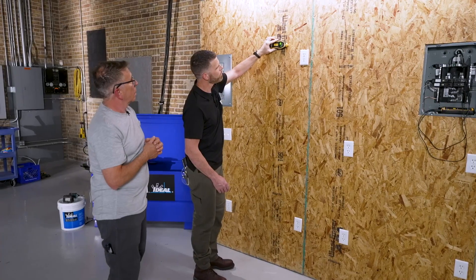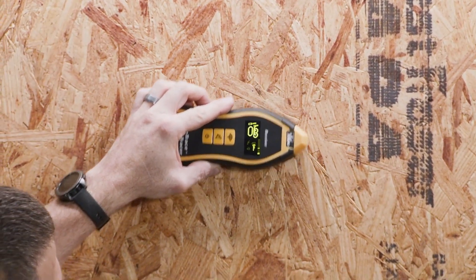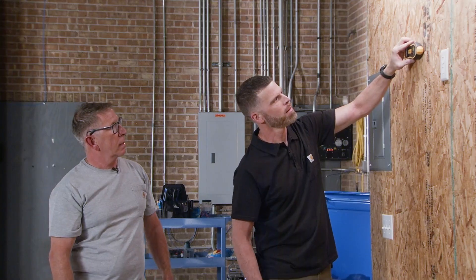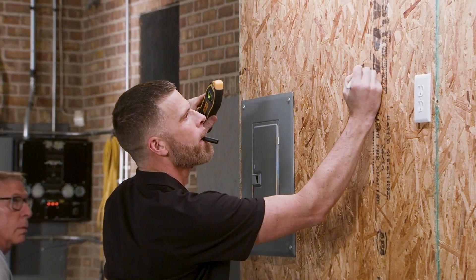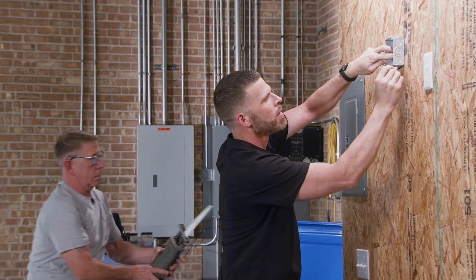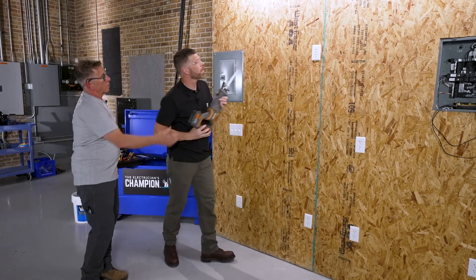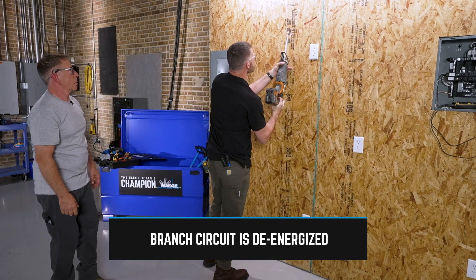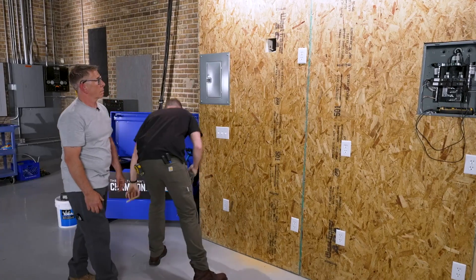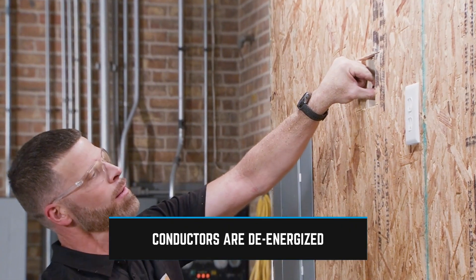I think you're really close right there. Now we're dropping off real quick. At that same elevation I'll come back and there we climb up in a hurry — right about here. I'd say it's right there. I'll be nice to the drywallers and try to cut a somewhat square hole for them to patch. Let's see how we did. There's our problem — a wire break right there. Who knows what hit it, but we nailed it right on.